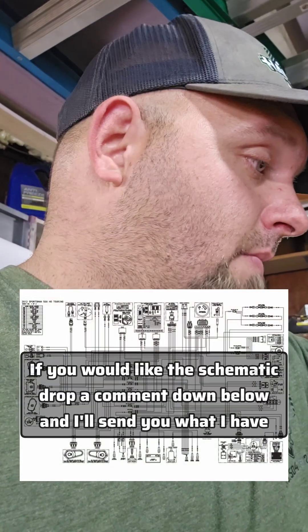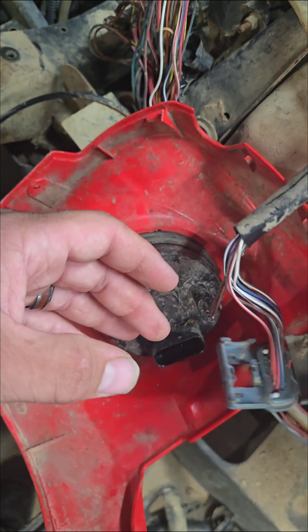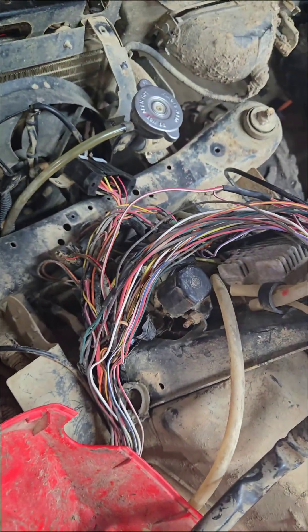Either way, I checked the wiring, looked at the schematic, saw where all my connection points were, and went all the way through backwards from the speedometer to see what it fed through. I ultimately cleaned a bunch of connectors going into the handlebar kill switch, made sure the key switch was good, checked splice connections, and rebuilt the fuse block. So now I've got speedometer — key voltage on pin 2, power on 1, and ground on 8 — and it wants to start.